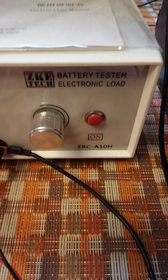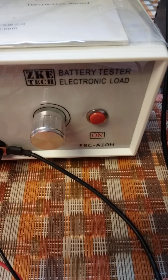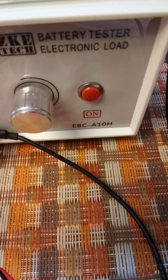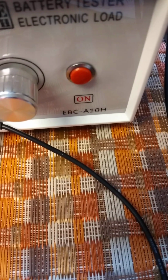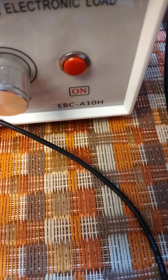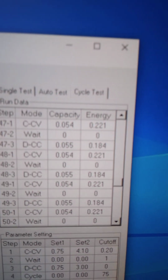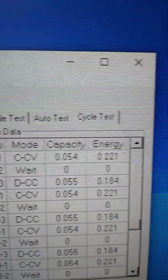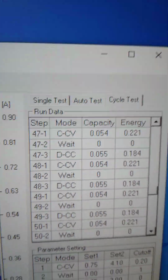And if you didn't see our other video, we use an electronic load device, ZKE Tech. They're excellent for the product, for the cost. You find them on Amazon, eBay maybe. Make sure you get the model A10H. The A20H does not do cycles, and you surely would want to use cycles. You can see the cycle test. You can also do auto tests, which I'll use with capacitors.